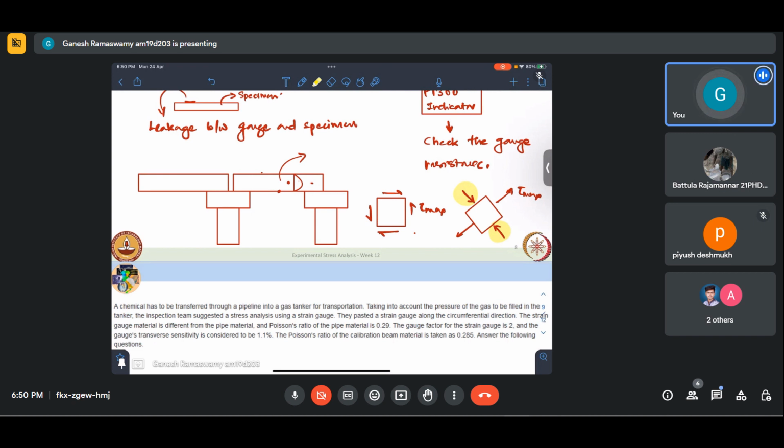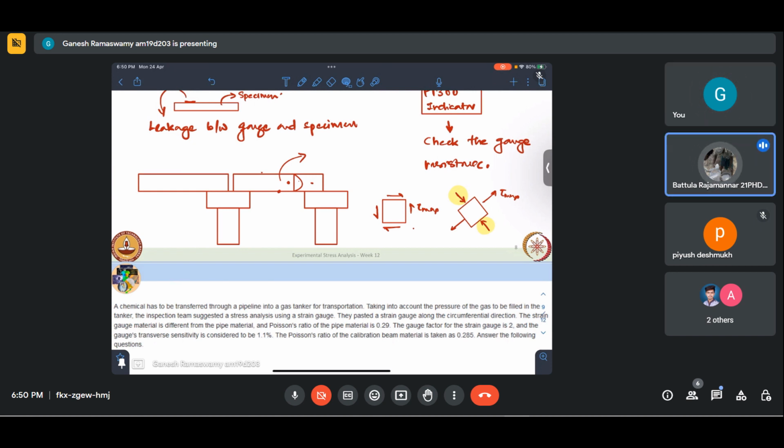This is web buckling essentially, but in the plane of the flange, buckling can take place. So buckling is a structural stability problem. In such cases, the entire bridge usage is put under risk. So we will identify such key points and then place strain gauges over there to see that, due to movement of the vehicles and whatnot, if the structure is very old, our strains are within the permissible limits. Is it clear, sir? Yeah.